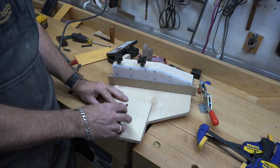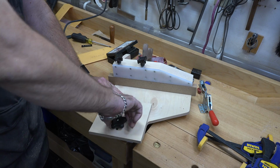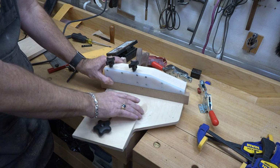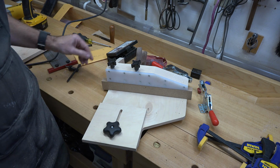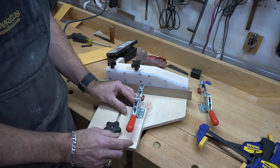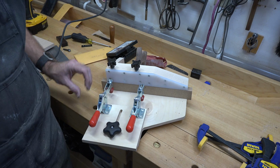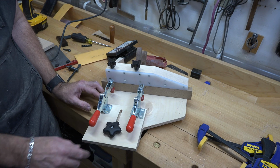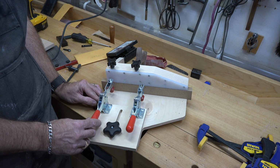We've got a fender washer here, and we should just be able to use a jig knob, spin it on there, line it up the way that we want, and crank it down to have it secure. And it is quite secure. I was concerned that with only one knob on there it may have shifting. The only thing left to do now is take this piece off, and we are going to mount our two hold downs just like that. So we'll mount them on this inside edge, as you can see here, closest to the fence, and that will give us the most adjustment here out of our particular clamps.